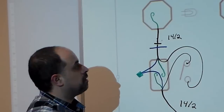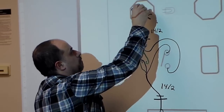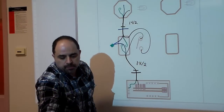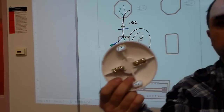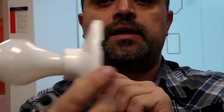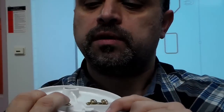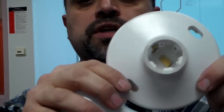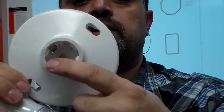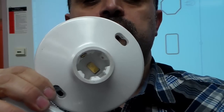When we get to the light, we're going to have a black wire and a white wire. Depending on the type of fixture you have — if you happen to have a keyless like we have today — you'll see that the keyless has screws on the back. One wire is going to go on one side: this is the neutral side, it's silver, and the brass side is hot. When looking at a simple keyless fixture, you'll see that there is copper on one side and copper in the middle — the middle is the hot and the side is the neutral.